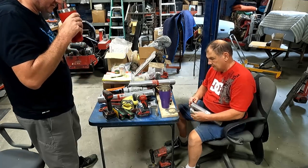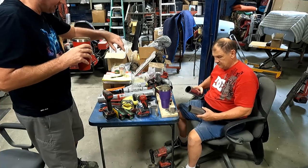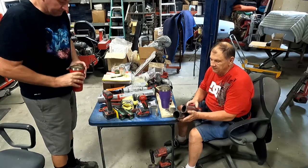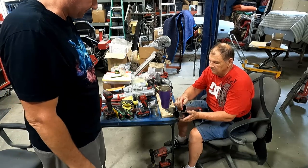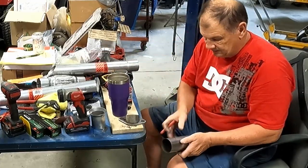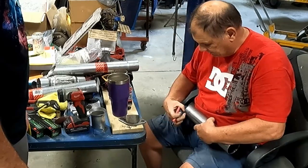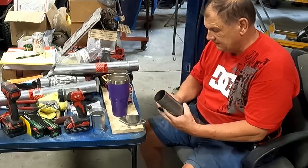We just eyeball it, is that what we did? That's where I wish we had that angle finder, because I think you can lay it on a pipe and it'll draw a circular angle. There. I can look at that, 45. Yeah, see now when it cuts this off, the piece is gonna be that long. There's gonna be that much meat on there. Yeah, I like that. Cool. All right, let's cut it.